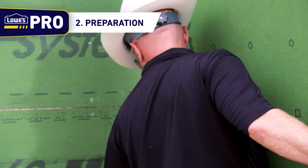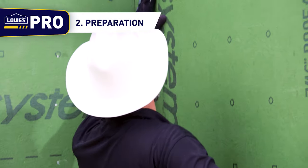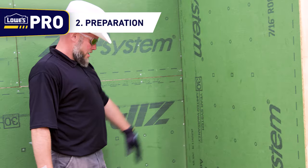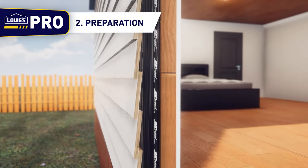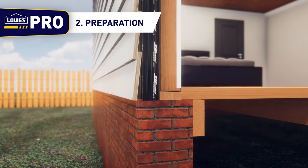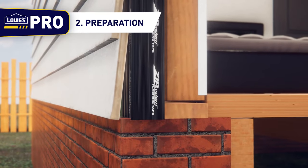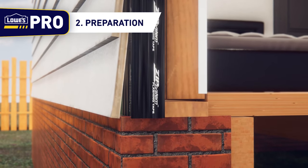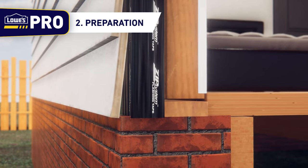Step 2: Preparation. Zip System panels can be installed both vertically and horizontally, and it's acceptable to mix the sheathing orientation. Best practice is to make sure that the sheathing panels are tying the floor systems and the wall panels tightly to each other. Overlapping the panels all the way to the sill plate and rim joist will create a good rack and secure tie-downs for better strength and longevity.